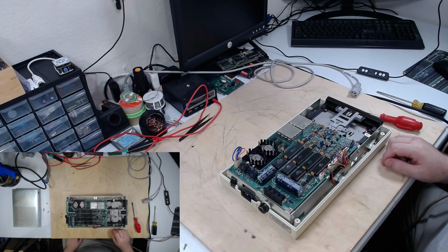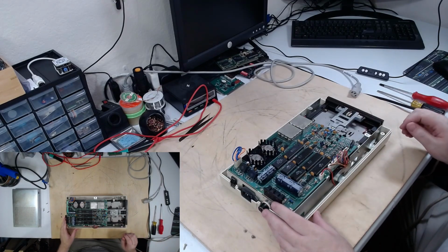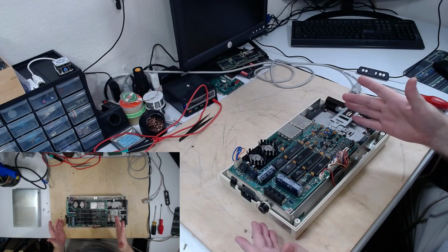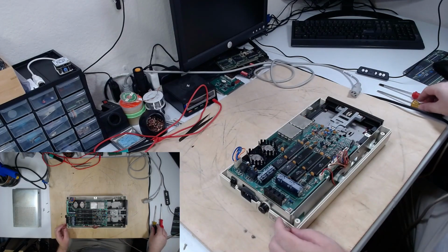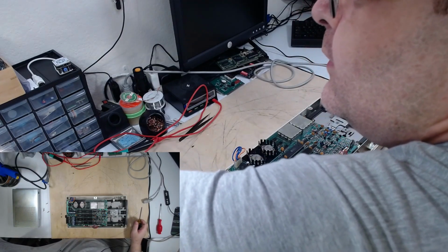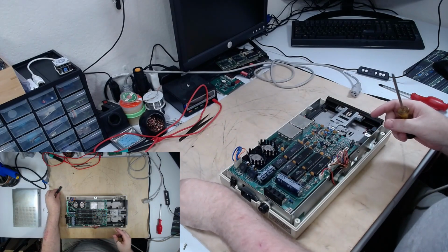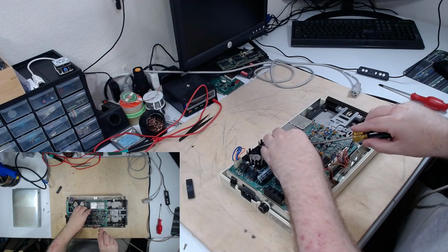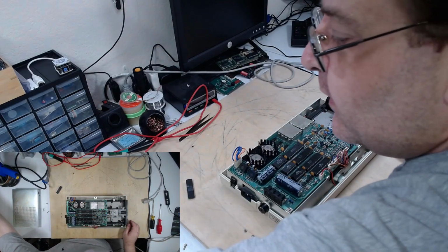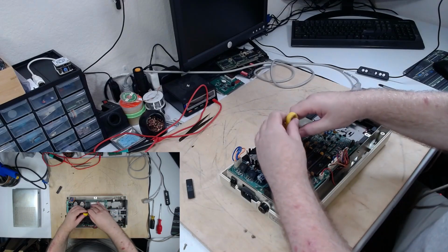Now I was racking my brain on how to get this to work, but very similar issue in another video I saw on a 1541, and it led to the 6502 on the board just not working. I happen to have some 6502s. Right up here, in fact. There's the replacement. See if I can very gently, not with that. I have a board certified chip puller.